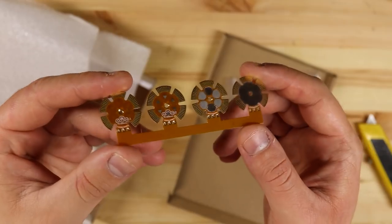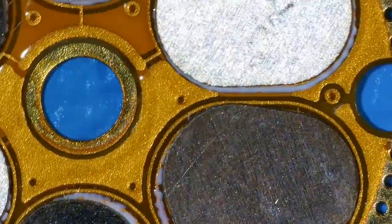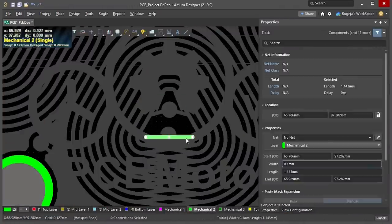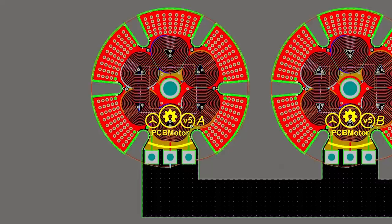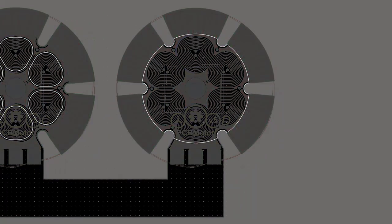The simplest approach was to use a flexible PCB with steel stiffeners. To make sure the motor doesn't cog with the steel, I selected the thinnest option and made four different designs: one without steel for comparison, one with six tiny triangles, one with bigger plates to cover the six coils, and a last sample covering the whole stator area.